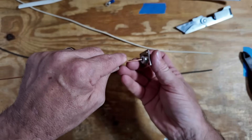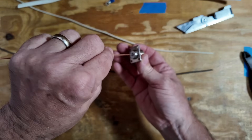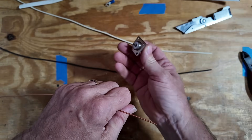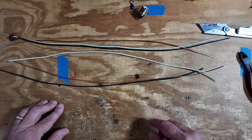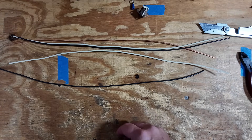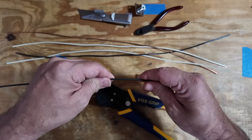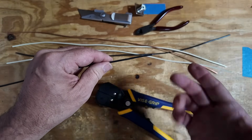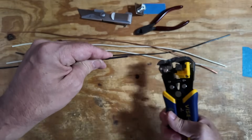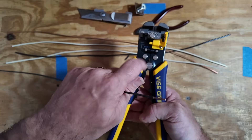Just as a quick sanity check, I'm going to make sure that the copper wire will fit into the center connector, because that's where one piece is going to go. Then we're going to attach the other four pieces to the outer corners of this coax adapter. After doing that a couple of times, that leaves us with six pieces. We'll just get rid of one of those bare ones since we don't need it, and we'll work with these remaining five pieces. One of the other things I'm trying to do here is keep this as basic as possible — not using any specialized tools, because if you're a brand new operator you might not have tools like these auto crimpers. If you don't have them, you should — I'll leave a link down in the description.